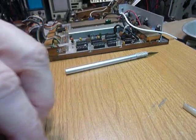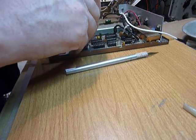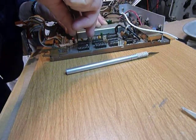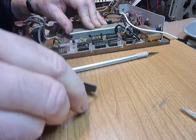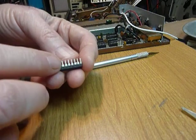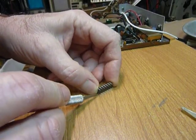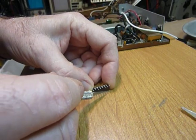Some of these pins are very dirty or quite corroded. I rock them back and forth a little bit to break them loose until I can get both parts of the removal tool in there and get them out. On one that's obviously quite corroded, I use an exacto knife with a number 11 blade — the pointed blade — and I just scrape each pin about three times.